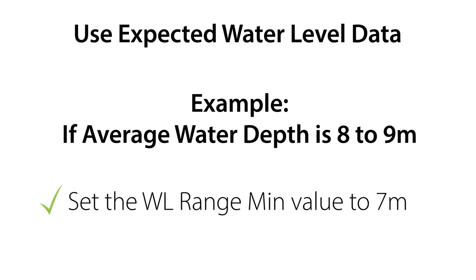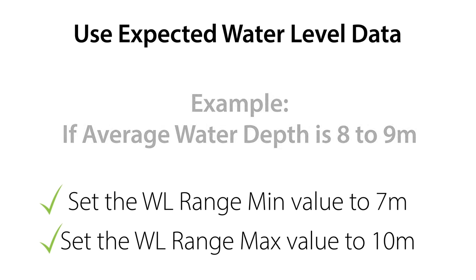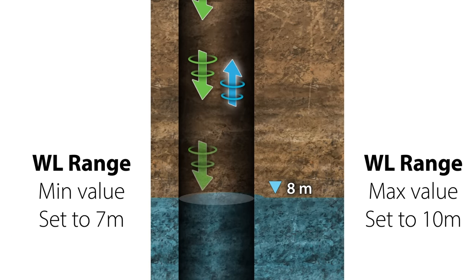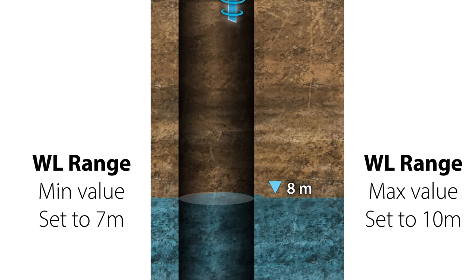In many cases, you're already familiar with the historical fluctuations in water level from previous well measurements, so you can use those values to your advantage. You can set the minimum and maximum detection levels to ignore obstructions and zero in on your measurement zone. For example, if depth to water is usually between 8 and 9 meters, set your minimum to around 7 meters and your maximum to say 10 meters. If you run into any issues or need to remove previously programmed parameters, the fastest way to start fresh is to use the factory reset option in the menu to return to default settings. Then start adding in parameters such as temperature and the min and max values if the reading you get is not as expected.